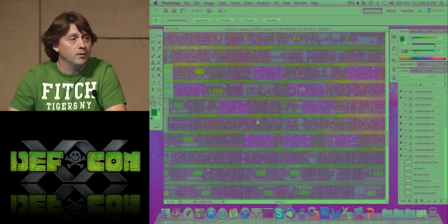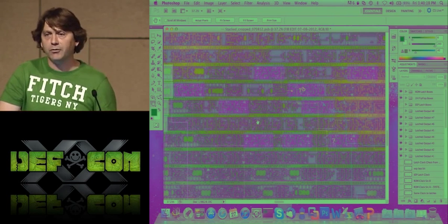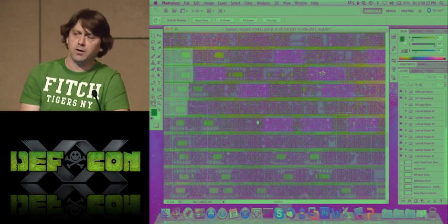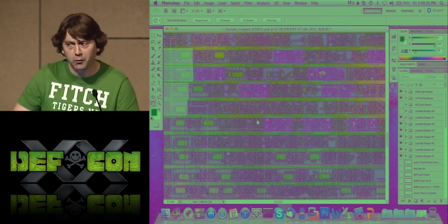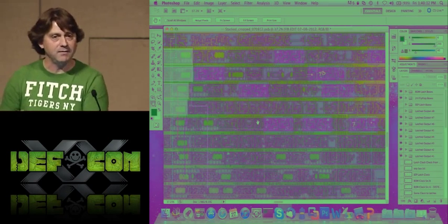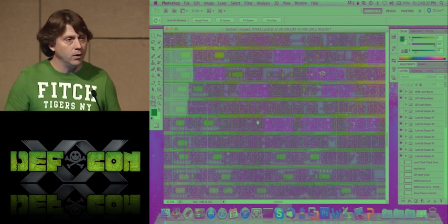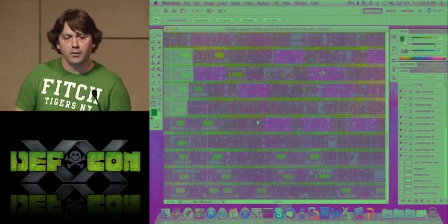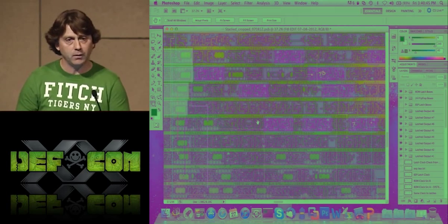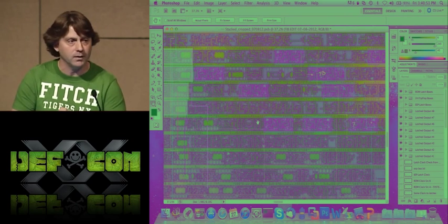I don't care about it because I want to care about latching an instruction into the CPU core and making it walk through time forever, while I listen with my needles. So this is the only side that could possibly be the instruction registers. We have 24 flip-flops. They're daisy chained. 8 that can feed again into 8 that can feed again into 8, which makes sense because anybody who knows the ST19 architecture knows that there are 3 levels of instructions. There's a few instructions that are 3 opcodes long, and to dispatch like another set of 256 possibly. And so this would make perfect sense of why it should be the instruction register.